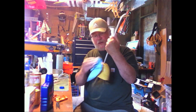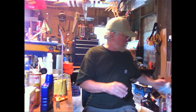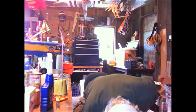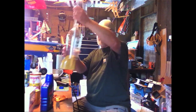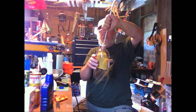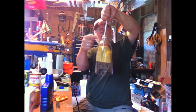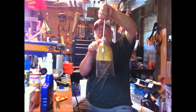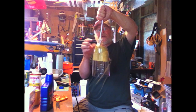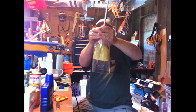Just wipe a thin layer on here. Get your heat gun ready. Put the bottle right over the mold like so. Now leave yourself some room at the top here because you need some of that softer material to shrink against the top of the plug. If you pull it down too far, you can't shrink it because it's already shrunken and it's difficult to pull it down over the mold. So leave it up a little higher.